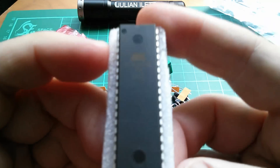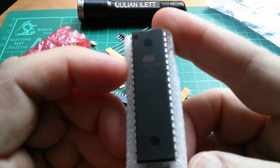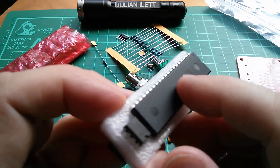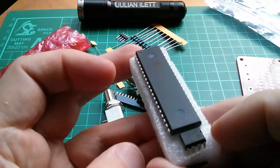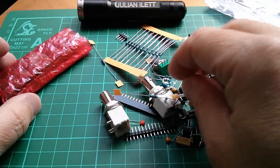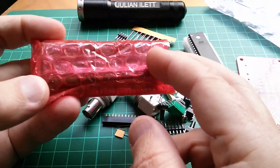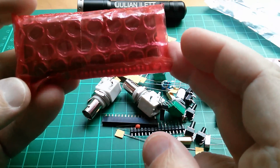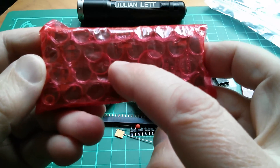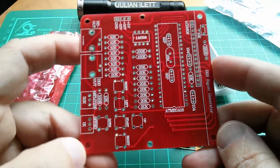Let's have a look at what we've got here. That's an ATMega 16A PU, and there's also a little LM358 on there. So this is the main chip — just a microcontroller, programmed presumably to provide all these waveforms. There are sockets, the two BNC connectors, two pots, and this is the 16x2 LCD — old-school alphanumeric type, a 1602A — and the printed circuit board, which does look very nice actually.